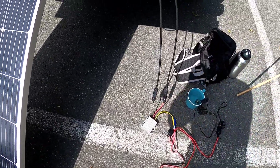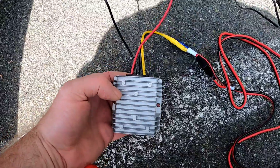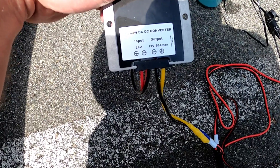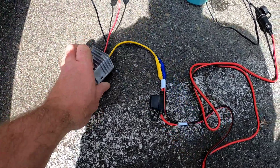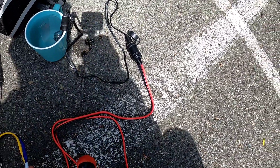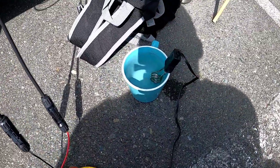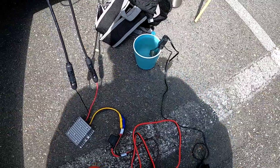I've got the lines coming off the solar panel with the extension cable for a bit of length, and that feeds into a little buck converter — about a $25 item on eBay. This one is a 240 watt unit; the input ranges from 18 up to about 30 volts, and the output is 12 volts with a 20 amp max — plenty for what I'm doing. I took the wire that connects to the cigarette lighter adapter, put an inline fuse with a 15 amp fuse into it, and it plugs into the immersion heater which feeds directly to the coffee cup. It's already getting lukewarm — definitely a minimalist setup.